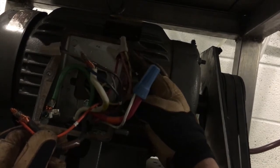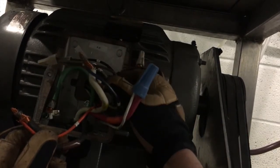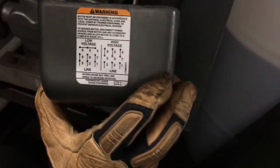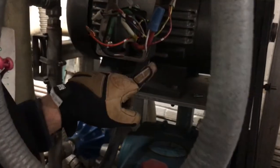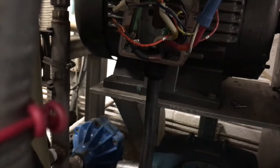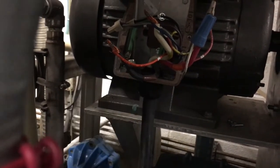And then these guys back here, the color coding is really just not very helpful. You have to tag these yourself so you don't mix it up. But 6 and 9, then 4 and 7, and 5 and 8. And if you look on that metal diagram I just had the cover — it was 6 and 9, 5 and 8, 4 and 7. So you can see right here that your white is going to have one wire to your large conductor coming up feeding from the disconnect — your line in. So anyways, I'm just trying to explain that schematic to you.